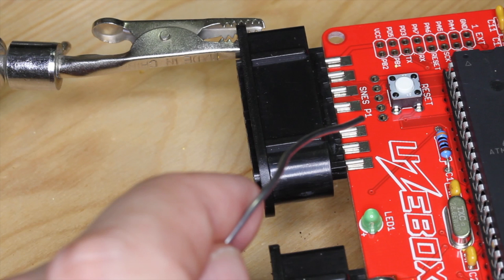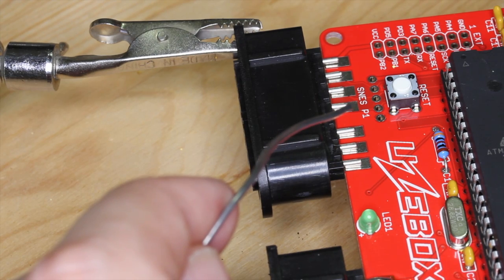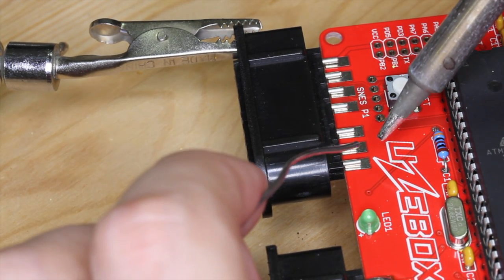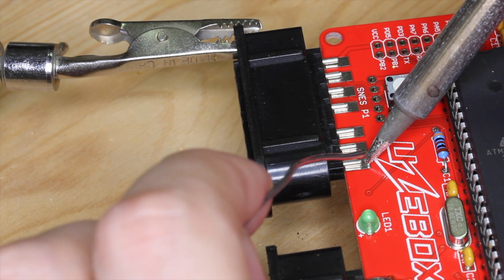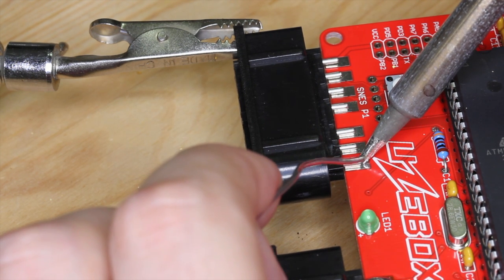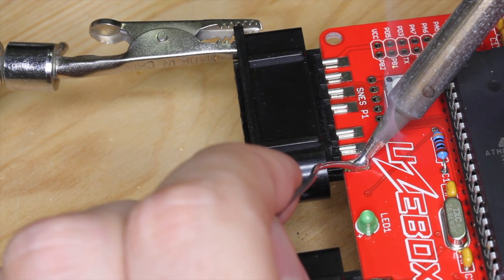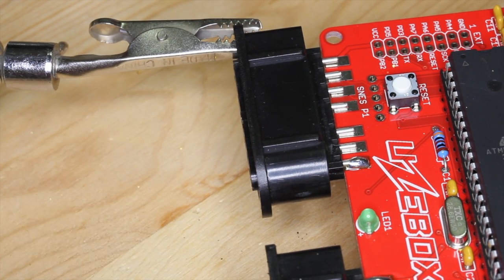The first thing you have to do is make sure the part is firmly held in place for soldering — I'm using a small clamp to do this. Now touch the soldering iron to the pad only and let it heat up for a couple of seconds. Then bring the soldering iron forward to heat up the pin and start applying solder. It should flow freely and create a good joint.